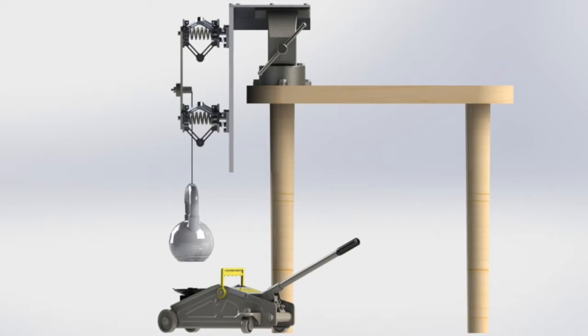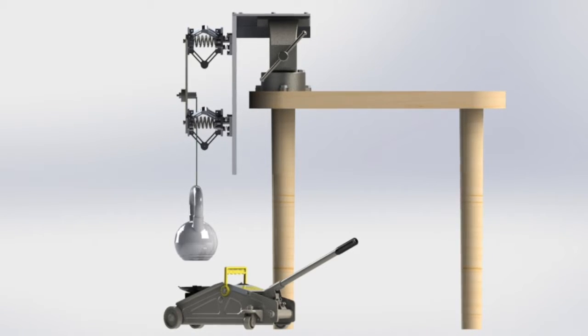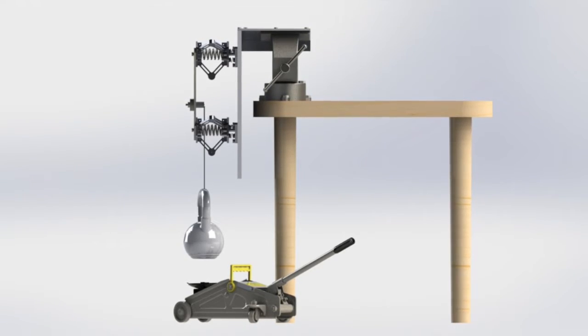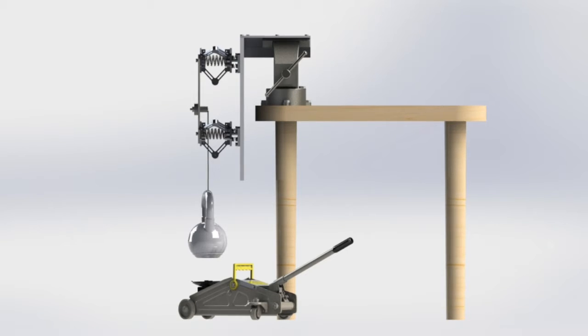Finally, we created an offloading testing procedure. Though not a primary requirement, this test accounts for the likelihood that the offset center of gravity of the payload attached to our system could alter damping effects. This test restricts one of 3 pedestals to the launch configuration and tests the resulting damping and natural frequency properties of the system.